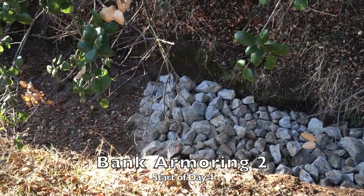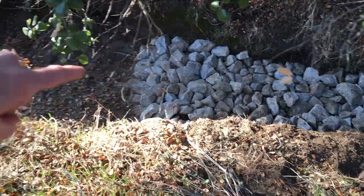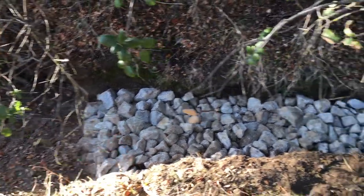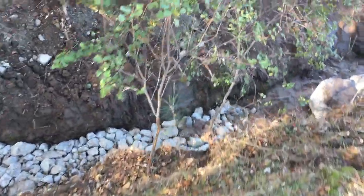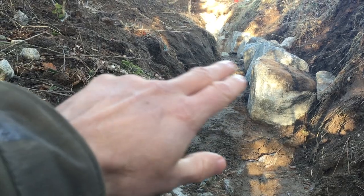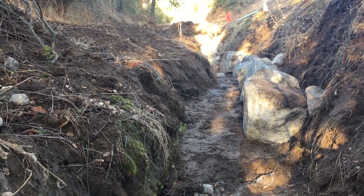Here we are at the beginning of Day 4 looking at the bottom of bank armoring section two — the second section where the gully got really close to the road. Right here is the lowest portion where water would be running down the gully. We have a sill dug in at grade, then a couple levels of gabion stepped down, and two courses of knitted gabion rock all the way up to here — some covered by silt from ongoing work. We've been dropping in larger boulders on the roadside, and everything is very fragile after the rains. We'll be dropping in a second and third course of larger facing rock here to ensure this hillside isn't getting hit by water during a really heavy discharge event.